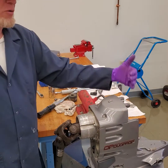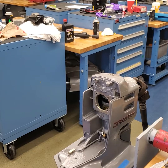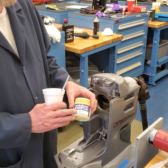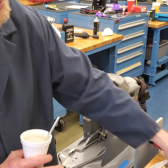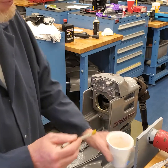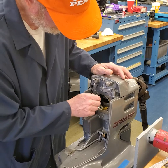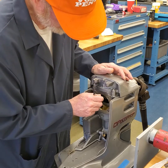That's a good sign. We're going to set our dial indicator up in the next video and measure the gear lash. We have measured the gear lash on the lower gear and the upper gear and have that dimension. Now what I'm going to do is mix up a little gear marking compound. If you're a Volvo dealer, you should be using this — it's basically a yellow powder, part number 3807716, called Marking Ink. I mix it with a little bit of gear lube using a small acid brush. I need to paint the lower and upper gear teeth on the convex side — the rounded side — from heel to toe and crest to root, meaning the whole tooth.